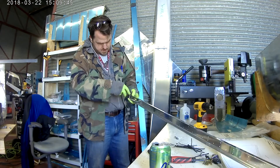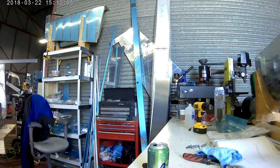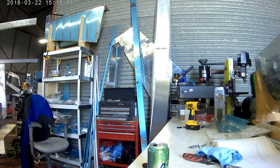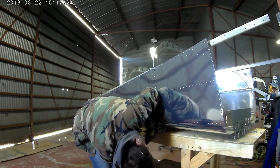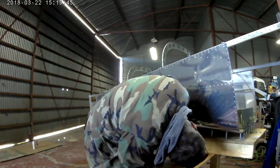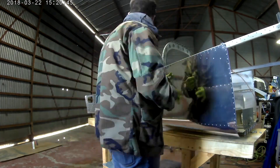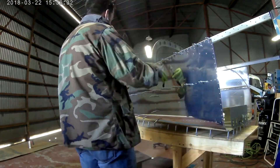For that reason I never really designed my own system yet — I've been kind of working on it. Take the tail cone for example. The idea was that the ELT goes in the back, on top of the very back of the tail cone, underneath the vertical stabilizer, behind where the empennage fairing is going to be. But I was also going to put the ADAHRS there, so then I need to move the ELT somewhere else. I hadn't really thought about that as well as I should have.